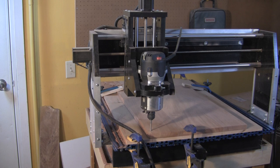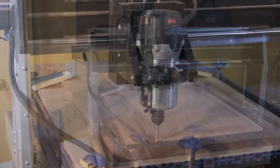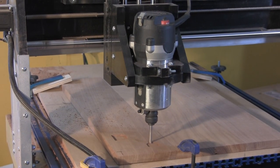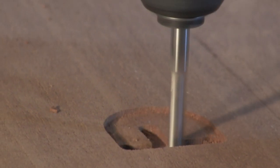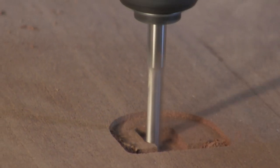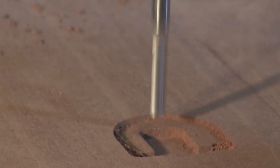The tray section of this project is the last piece that needs to be made. Once again, the hinge pockets are machined to size and depth, but these hinge pockets are shaped differently from the ones on the side handles. The tray hinge pockets have small rectangular mortises cut deeper into the pockets that provide room for the spring-loaded sections of the butler tray hinges.